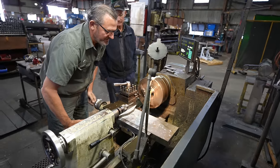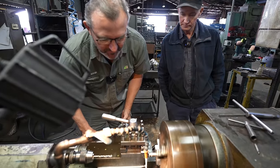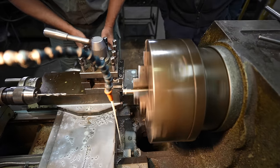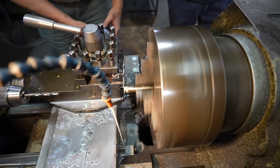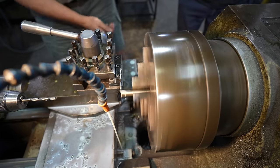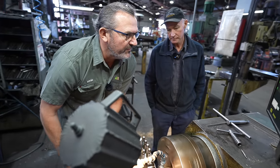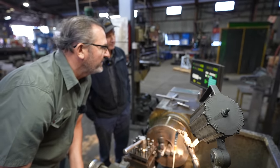Yeah. So you just come up to it so we can zero off to get our length. So we need 15 mil, I think, for a short one. Give it a punch. Like that, but also we've got a true edge. Little by little, and then we'll zero that off and then just add. So we need 3 mil for our tool width as a parting off, and then we need 15 for a small bush, so we get to 18.